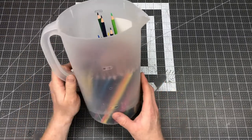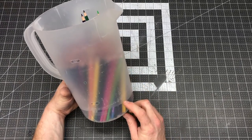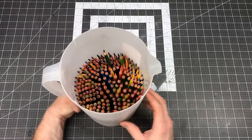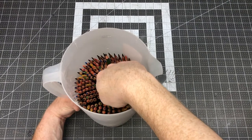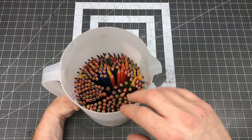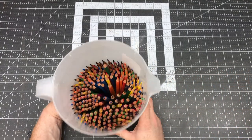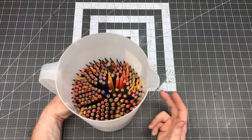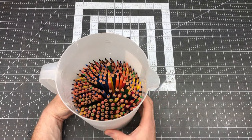So what we're going to do is use this picture here as our mold, and we're going to put a waste block down in the bottom, then we'll put our color pencils on top. For those color pencils, what I'd like to do is stick a core of just another wood here in the middle, and that will take up some space so that we're not having to use color pencils for that space. So let's head over to the lathe and we'll work on our core as well as our waste block and get that all prepped so that we can start putting this together.